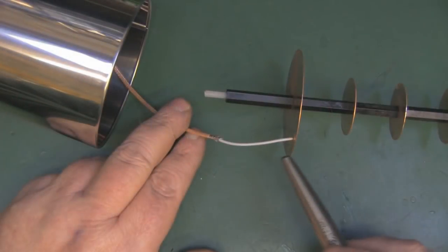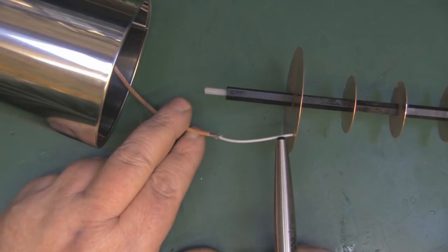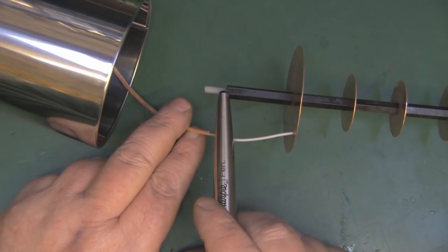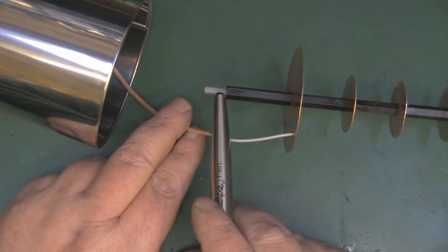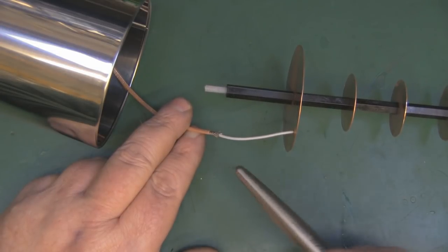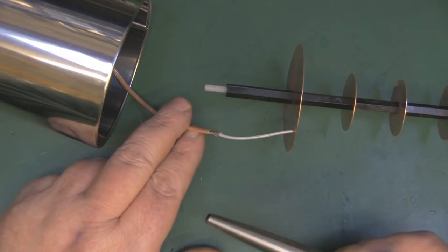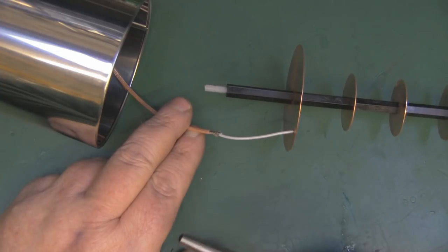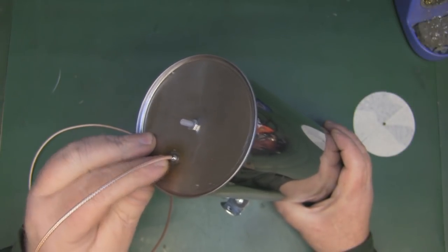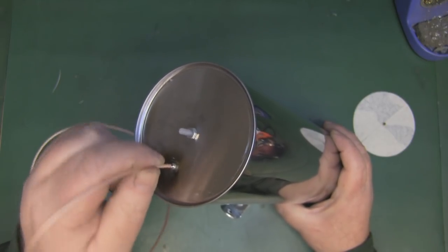This is probably the trickiest part of the construction. I've removed quite a lengthy piece of the outer braid — slightly longer than the distance to the back of the can — and pre-tinned it so I can solder it to the back of the can. The coax is also connected to the main driven element. I carefully thread everything through the back of the cantenna and cut away any excess coax. I use plenty of solder to make sure it doesn't accidentally snap off.